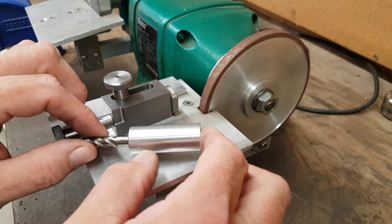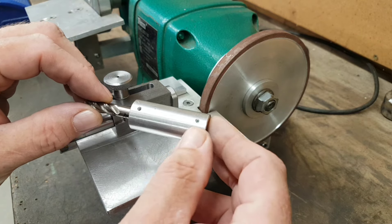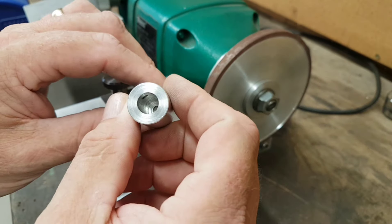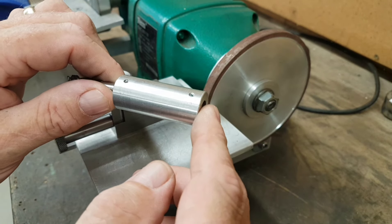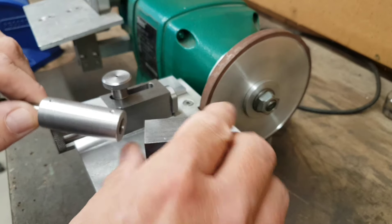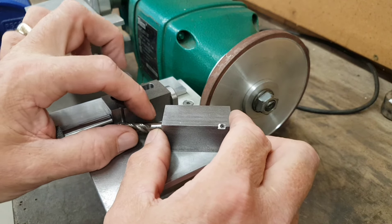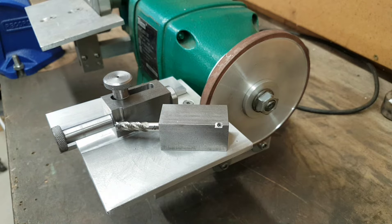To sharpen smaller end mills than 20mm you basically make an adapter sleeve up with a couple of M3 grub screws. There's a rather cheap 8mm end mill in there, and that's drilled to 10mm on that side, so one of these little sleeve adapters will do for two different sizes of cutter. It's a case of dropping it on, sliding it into the boss, coming towards the shelf, and rotating it onto the shelf so it sits there.